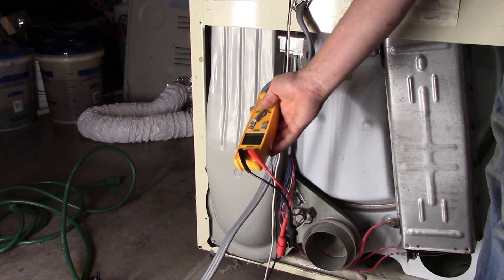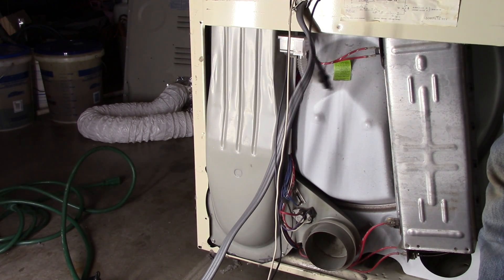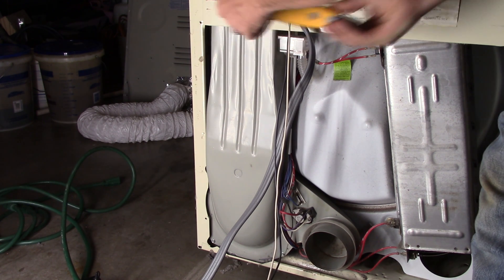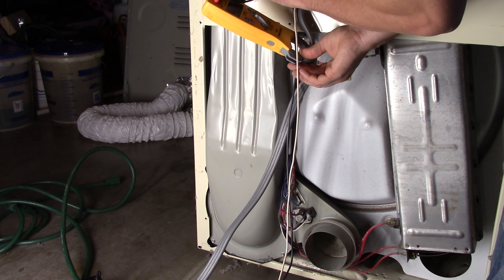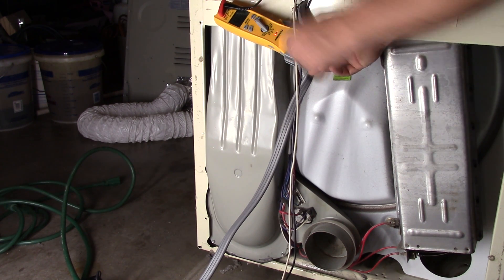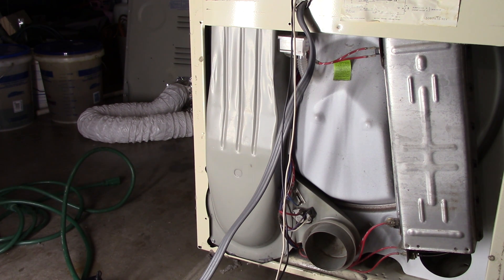Right now we're running at 12.8 amps. The voltage is 109 volts at 12.8 amps. So you're looking at 12.8 multiplied by 109 for the wattage — that's approximately 1395 watts. You're definitely using less power than a standard 240-volt dryer, though it's not doing a lot of heat quickly, and it is circulating the clothes more which wears them out faster.